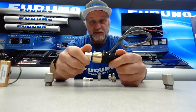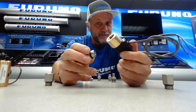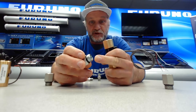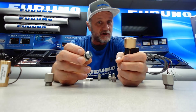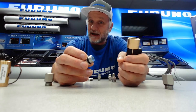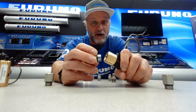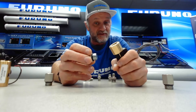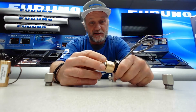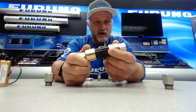You can switch fittings on the fly and tighten them up. By the way, one side of the adapter fitting is an ORB number 8 fitting — an O-ring fitting. ORB means O-ring boss. When you see an O-ring on an adapter fitting or anywhere in a hydraulic system, you should never use sealant, thread sealant, or Teflon tape on an O-ring boss fitting or an ORFS fitting. You just don't use sealant — let the O-ring do the sealing. That's how these are designed.